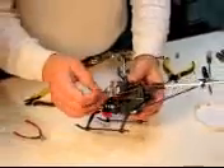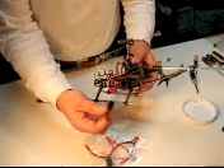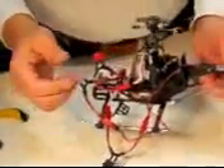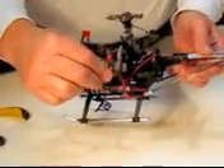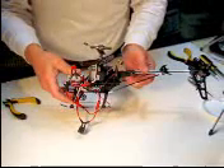I think I'm done here. I got the wires mounted up. But the next thing we're going to do is put on some fuses to protect my main motor and my tail motor, and then put the on-off switch. I have my 10 amp fuse to protect the main motor and my 3 amp fuse to protect my new tail motor. I have my cute little on-off switch. Now I need to bind this and see which way that prop spins to see if it's the right way.